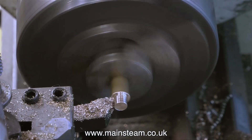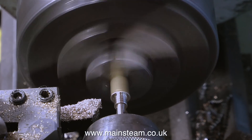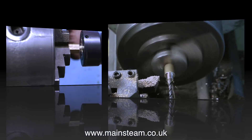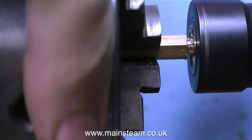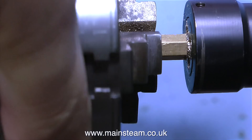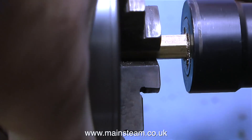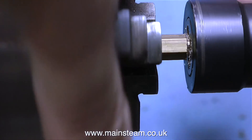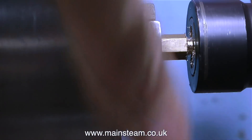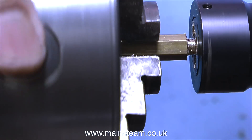I'm using a piece of brass hexagon and I'm turning one end of this down to exactly a quarter of an inch. Then as always I use a center drill followed by a twist drill. If you wonder why I use a center drill — I would suggest that if you have a lathe, try drilling a hole in the end of a piece of brass without using one and watch your drill wander all over the place. A center drill is just a very short, stubby drill that drills holes in the end of pieces of metal without wandering. In this clip I'm using a tailstock die holder to cut the thread, and as you can see from my large thumb being out of focus in the foreground, I'm turning the chuck by hand, not under power. By the time I've engaged and disengaged the back gear it's quicker doing it this way, because it's only a very short length of thread.